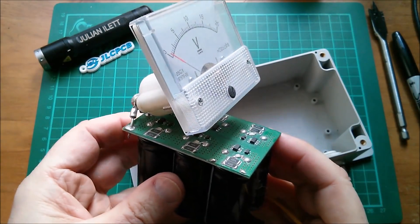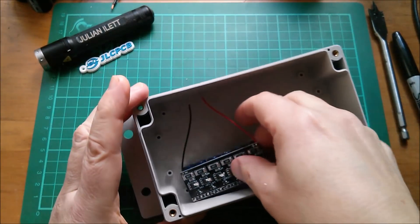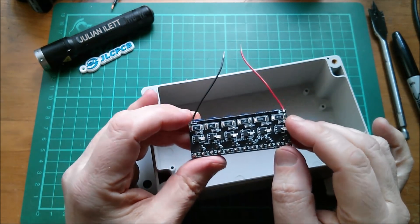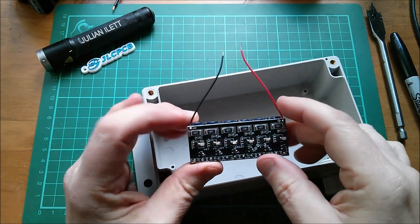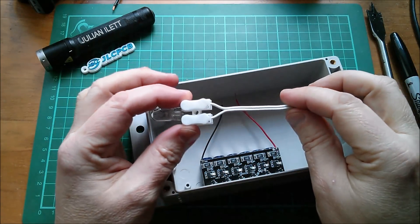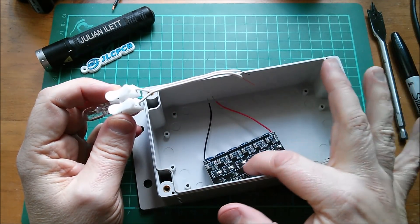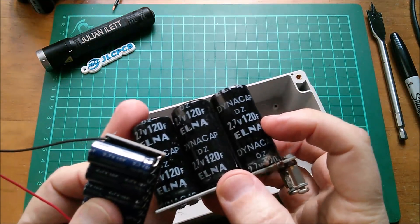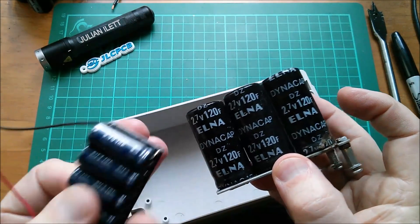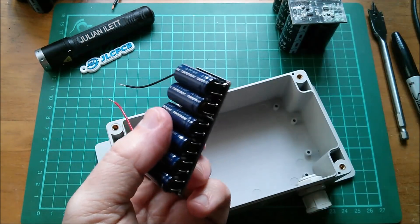I was just thinking - rather than take this apart, because the intention was to put it on the Muppet 2 project - maybe I'll try this little tiny one instead, because that light only comes on for about 10 seconds at a time. Maybe I'll just put in an order for a slightly bigger one too. I can use these connectors to quickly lash it up and see whether a smaller supercap bank would work. This has got LEDs stuck on it, and instead of 120 farads like the big ones, these little ones are just 10 farads.